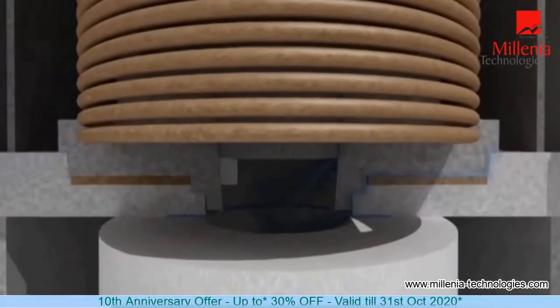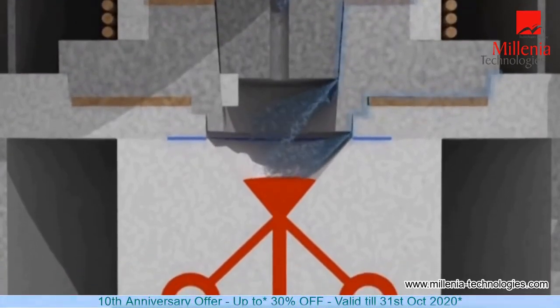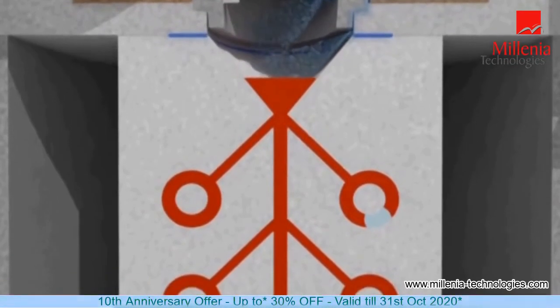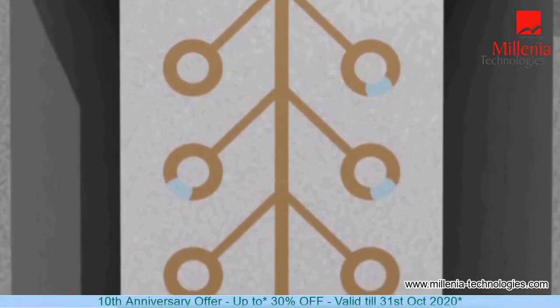This phenomenon, together with the metal injection speed, creates gaseous formations, which cause improper filling, damage to the investment and rough surfaces, as in the old centrifugal systems abandoned a long time ago for the casting of gold and silver.